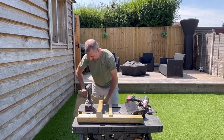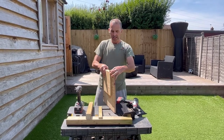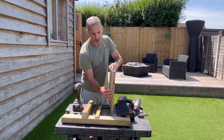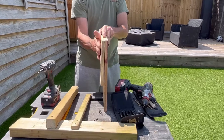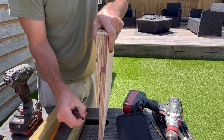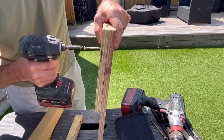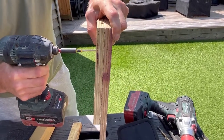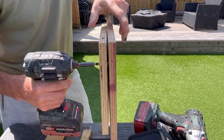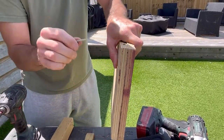The last example: let's say this is two kitchen cabinets being fixed together. This is the front where the doors will sit — you've got two cabinets joined at the front. If you were to use an aggressive screw in there without a pilot, it's going to pull the panels apart. Can you see how it's pulled it apart? That exaggerates the problem even more.